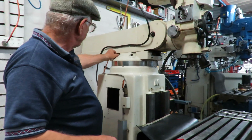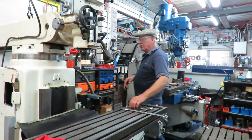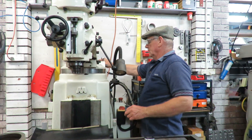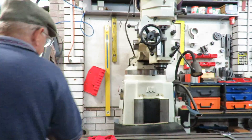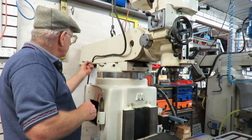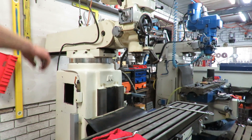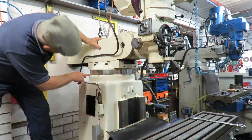I'll just release those off a bit more. The spider is dropping — I can feel the spider actually. The bolts have dropped, which means the spider has dropped, so that's released a bit of pressure. And there's not much more thread in there, so once that releases the spider's dropped. We'll now see if we can break that bond by tickling up the crane first. Got a bit of weight on that — it's broken away here. Now we'll come to the other side.